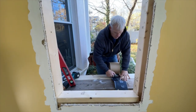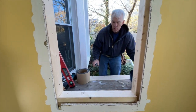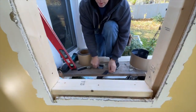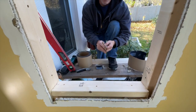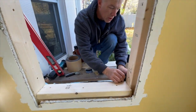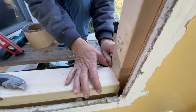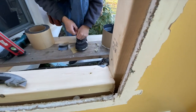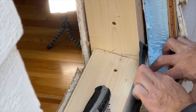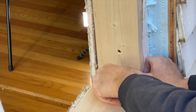It begins with little corner pieces followed by sill flashing folded down and sealed to the existing WRB. David's old school — he uses non-stretchy flashing membrane because flexible stretchable flashing tapes aren't always available to everybody, and he likes to work with good old reliable materials you can get everywhere. He puts in the sacrificial corners first, cut and stretched opposite of the sill flashing. The little corner pieces are just to provide protection to that corner of the sill, cut just shy of the corner, and then the flashing tape is stretched over the vulnerable point.